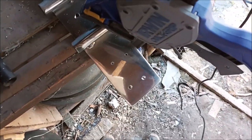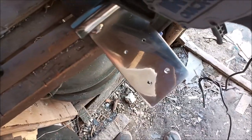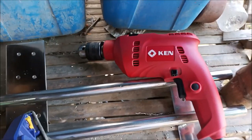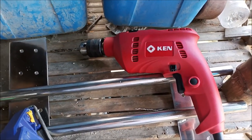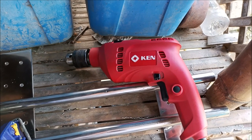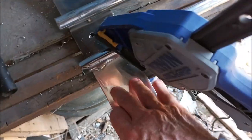If you try to go full speed it burns up the bit. If you go too slow it just gets a smooth groove and starts sliding without cutting. But if you do a stop-start motion at low speed it just keeps digging its way through. That's been my savior — go slow with a stop-start kind of fashion. Your drill is going to get hot too, so let it cool off every six or eight holes because you're dumping high current through it while going slow and the cooling fan doesn't spin effectively.